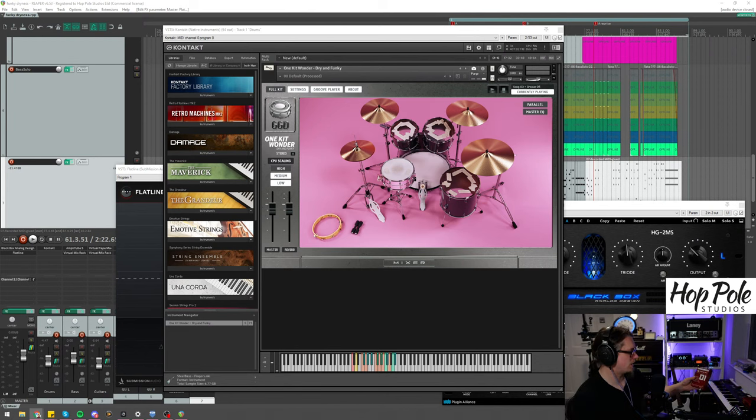Active DI boxes avoid that. This one doesn't have a transformer in, as an example. This is a transformerless DI box. It's a Class A discrete direct box, but that is a very clever design and they're quite rare. I also have some valve-based, tube-based DI boxes at the studio, which really add an extra tone. They change the sound a bit, which can be quite nice, or it can be detrimental depending on what you're doing.